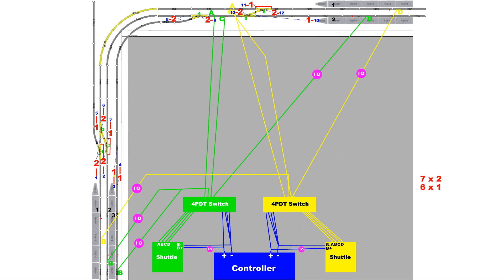Signal 1 also serves two additional purposes due to the proximity of things. It serves as the passing signal for point 3, the crossover point. If the right arm of signal 1 is set to safe, this not only implies that point 1 is set straight, but also that point 3 is set straight. If point 3 is set to turn, allowing crossover with the line from platform 2, the right arm of signal 1 will be set to danger. The third purpose of signal 1 is as the starter for platform 1. Since it is so close to the end of platform 1, it should readily be seen by trains there. Trains may only move out from platform 1 if one or other arm of signal 1 is set to safe.